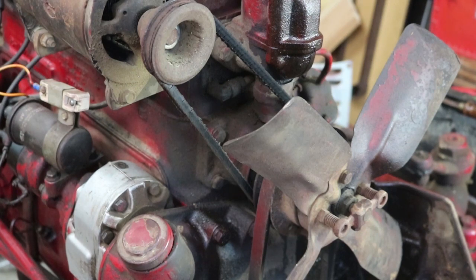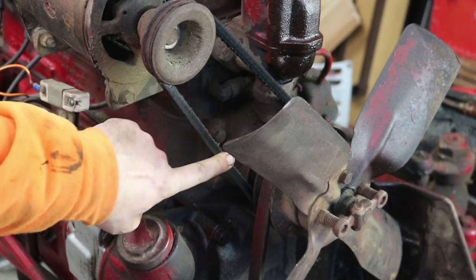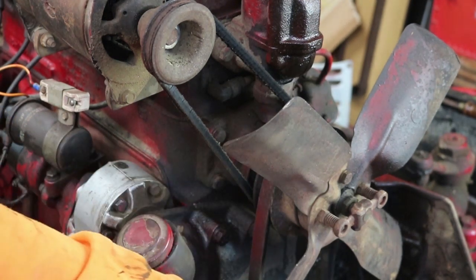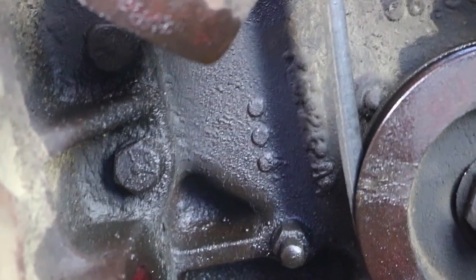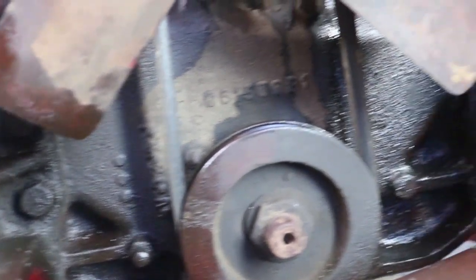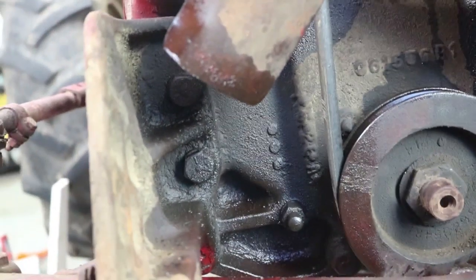Now that we can see the front end of the tractor, we can see things like the belts. Here's the belt going up to the DC generator — that's really cracked, and if we were just doing an overhaul we'd definitely want to replace that. The belt for the fan looks in pretty good condition with nice new lettering; looks like somebody replaced that not too long ago. We can also start to see some of the bolts that hold the engine to the front end — those are the ones that will have to be undone to remove the front axle, and they'll also be the mounting points for a new metal cradle that will take the place of the engine's structure to hold the front and back halves of the tractor together.